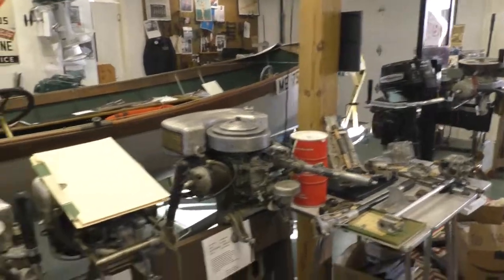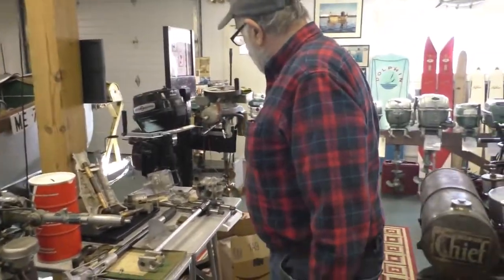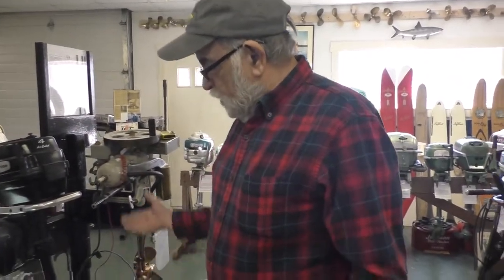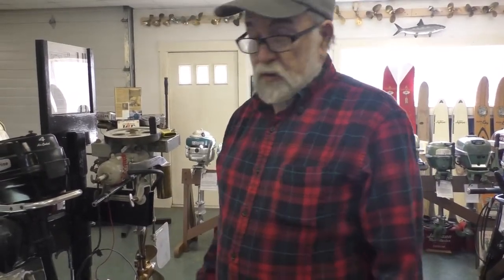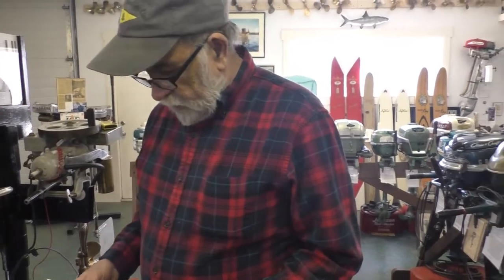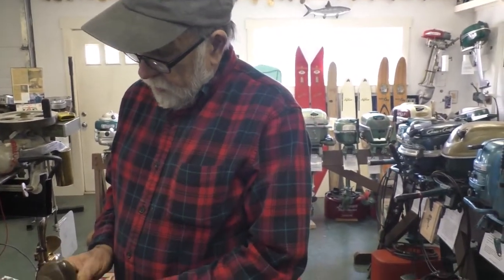So one of the last little pieces that we could talk about is some repair techniques. Some of this stuff is pretty straightforward. Having a damaged crankshaft, any of these parts, if they're damaged, are trouble because there are no replacements at all. But on a solid bearing system, you can spray metal and turn it down, unlike a roller bearing. Or you could just grind it. This one would take maybe a 5 thou grind.